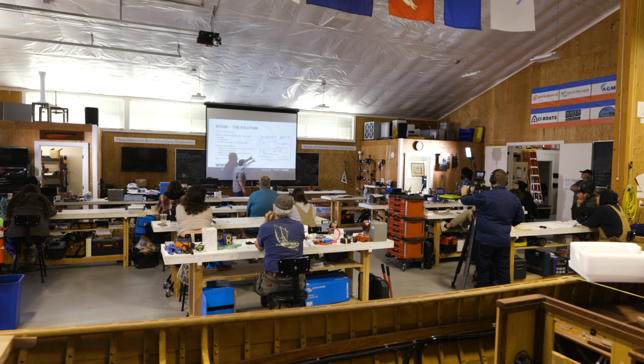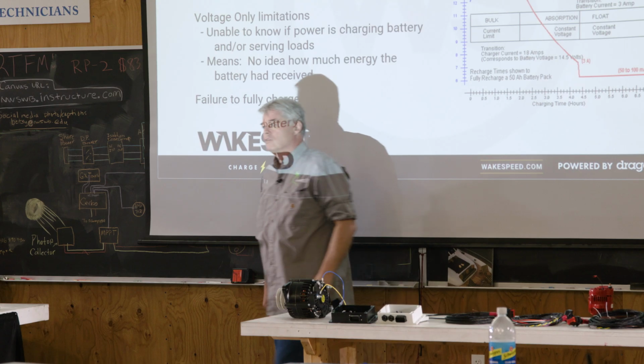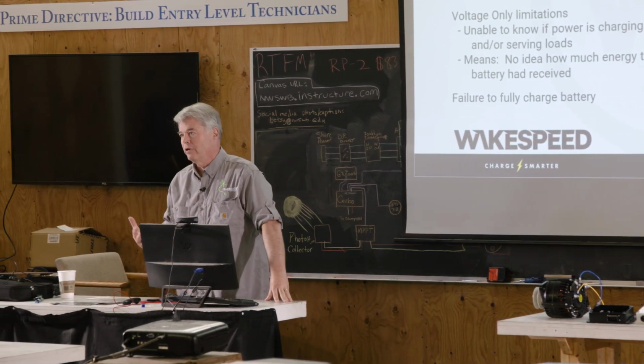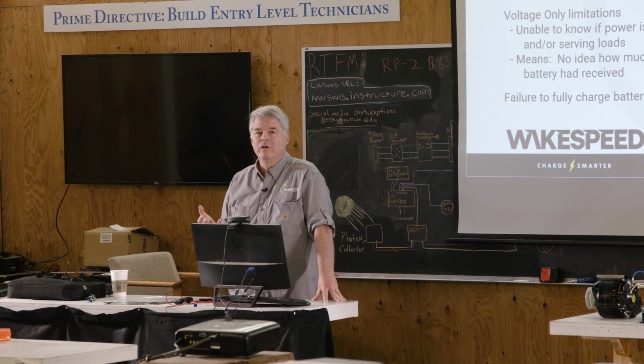If you're doing a field proxy, because to get that 150 amps out of the alternator, we're probably at 80% drive on that alternator. If you're doing a field proxy measurement, that alternator thinks you're way up here. It doesn't know that it is going to the dryer instead of the battery. So it's going to keep charging the battery, even though the battery's only taken a small percentage. Guess what? You're overcharging your battery. You're damaging your battery, which is why a lot of these ones that try to infer what the battery is doing, they'll have a timeout.